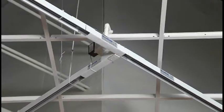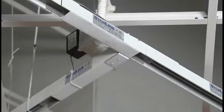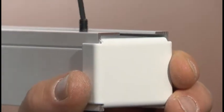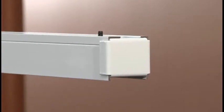Repeat the previous steps until complete. Note that tees, elbows, and center feeds are connected in the same manner as straight sections, and they all have the connectors built in. Once the busway is hung, install the end cap at the end of the busway run and tighten the set screw to secure it in place. It is necessary to install end caps for finger safety.